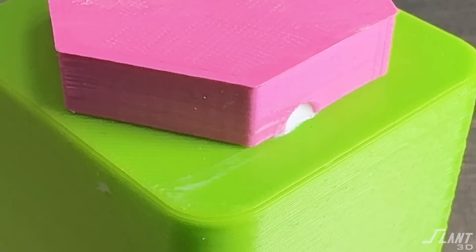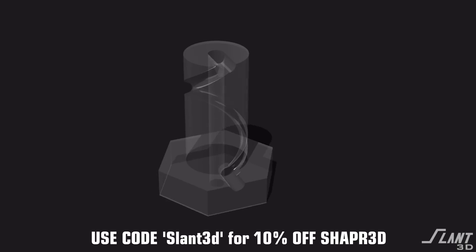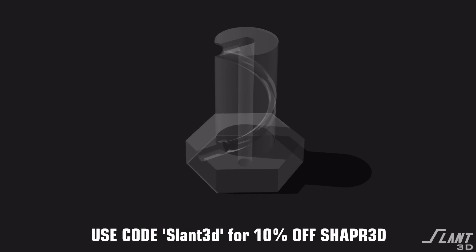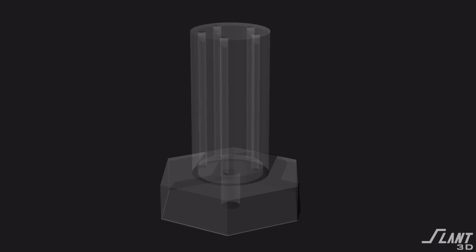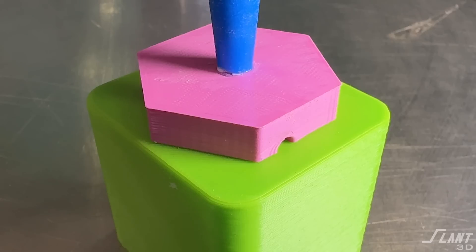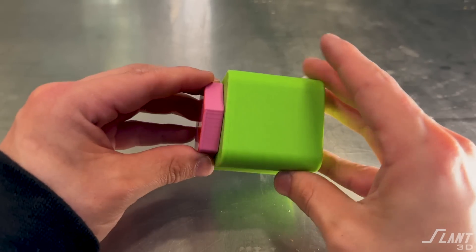You have a very clean spot where the glue exits, so you can see it, wipe it down, and have a cleanly placed piece. These glue slots are a great example of the advantage of 3D printing — you can create really complex and dynamic geometry that allows all types of post-processing that was never possible before because it was too expensive or outright impossible. A mixing chamber inside a part is completely unmachinable; it could never be molded or made any other way. Now you're able to distribute fluids and glue throughout a part and dispense it where and when you need it after assembly. It's much cleaner and requires far less skill than evenly coating a part and pressing it in.